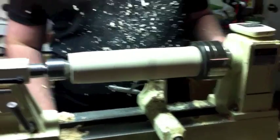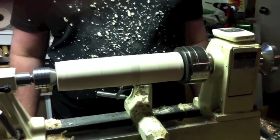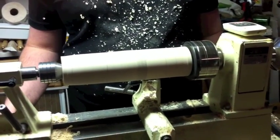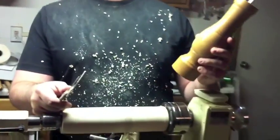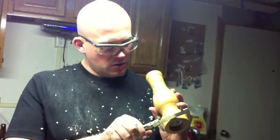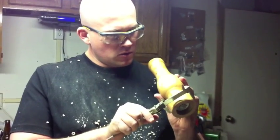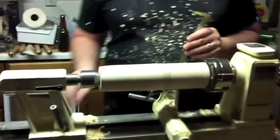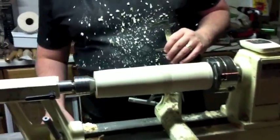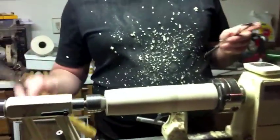The next step is to actually measure out the critical areas with some calipers and use the parting tool to make waypoints to cut and turn. Now we're going to deal with some of the critical dimensions of the actual pepper mill, so I'm going to use a set of calipers here. I'm going to measure out the base. I don't really worry about how many inches or centimeters it is. I'm going to use my parting tool and transfer this measurement right onto there.